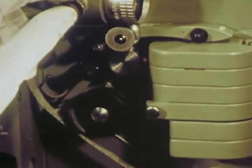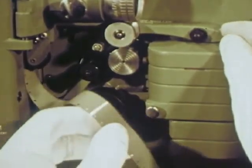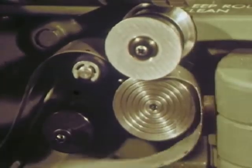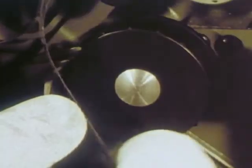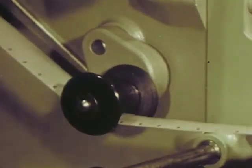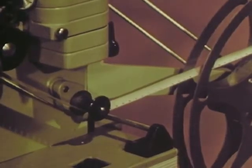Close the gate. Form the lower loop to the guide marker and pass it over the dynamically balanced sound drum where the sound is picked up. Thread the film under the lower sprocket — there are only two in this machine — under a damper roller which helps prevent film breakage, and onto the even tension take-up which adds the ultimate in film protection.